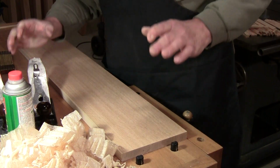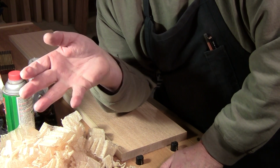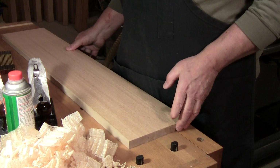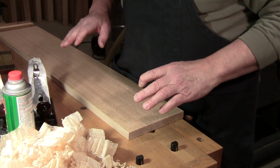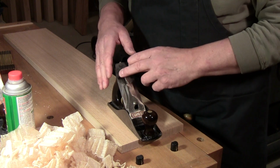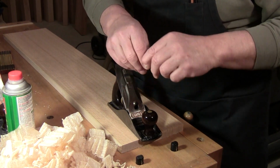Now, the biggest tip I can give you, you notice when I say there's a tip, okay? It's important, so you should listen, okay? Or don't, but when you're done for the day and you're done working your wood, besides stacking it and making sure it can air dry evenly, etc., you really need to, or should, take your plane apart, dust it off, and wipe it down with a little bit of oil of your choice. Take the blade and chip raker apart, clean, dust it off, oil it.